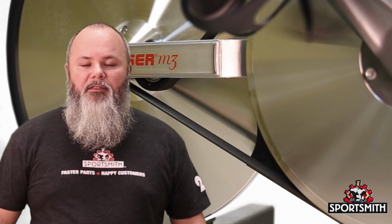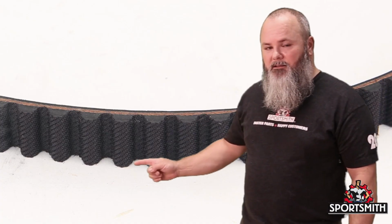This video will describe the differences in drive belt types. We also cover some of the things you need to know before replacing your drive belt. There are several different types of belts on fitness equipment. This video will focus on three of the most popular: Poly V, FLEXONIC belts, which are also a type of Poly V belt, and HTD belts.